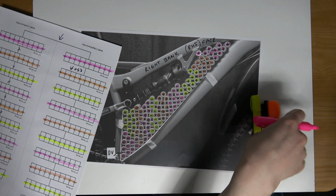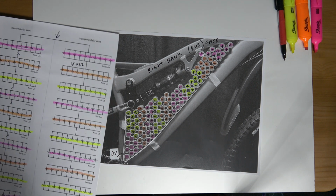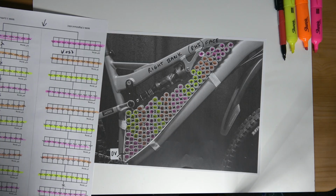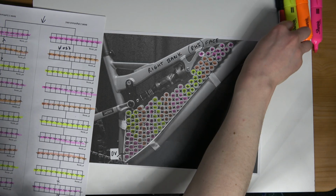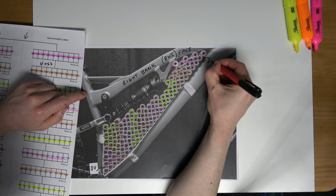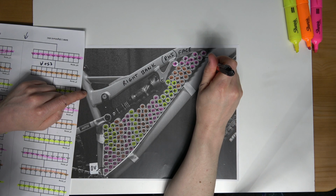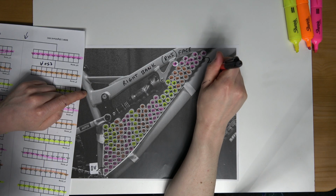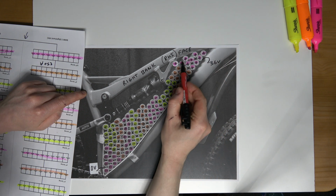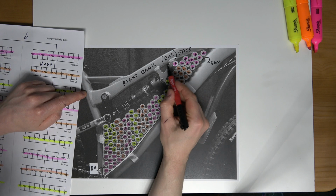Okay, that's one side complete. So I need to do this now 3 more times. So what I might do here is go ahead and complete these, and then I will, oh, one final thing. So at this point here, there will be 36 volts. And this is where my series connection will be connected to the left bank. So this cable might actually just go through this loop. I'm not sure yet if it's 16mm squared cable that I need to use or what it is.